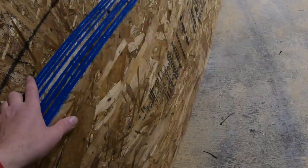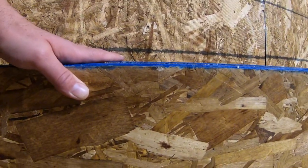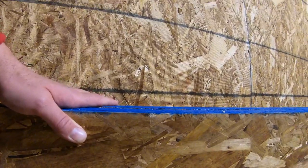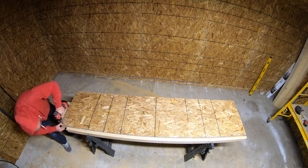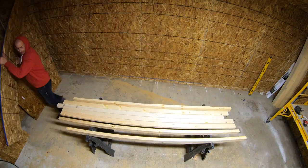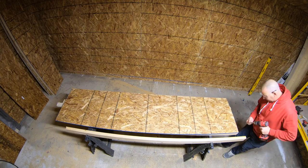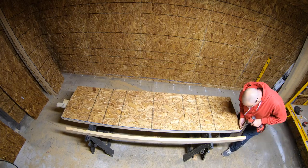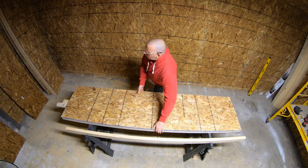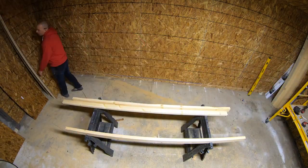I have eight pieces all cut to just under 24 inches — now let's start fabricating the shelves. To get the most strength, screw the OSB or plywood to the small edge of the 2 by 3, using six to eight screws down the edge. I'm using 2 by 3 by 8-foot lumber with 3/8-inch plywood or OSB. The next step up would be 2 by 4 with half-inch plywood; for warehouse or heavy paper storage I've built with 2 by 6 and 3/4-inch plywood.